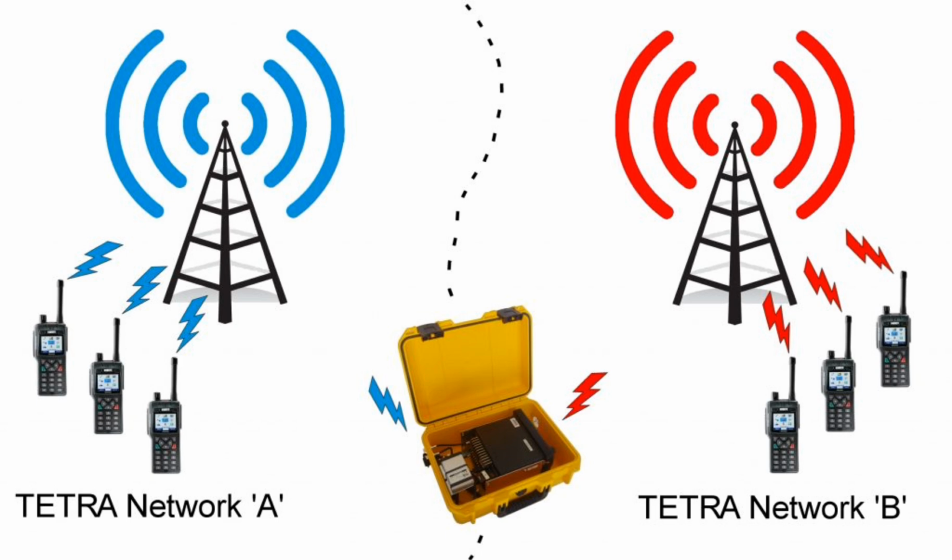It's basically a measure of how good the GPS signal quality is. For initial setup, it needs to be really low, like under 2.0. For normal operation, below 10.0 is generally okay. It's the system checking its own navigational accuracy, which is vital for timing.